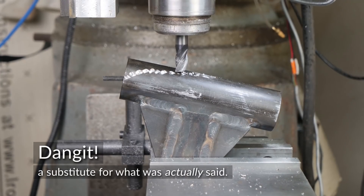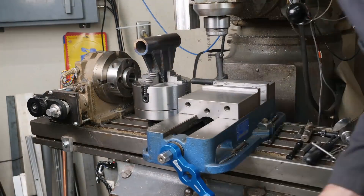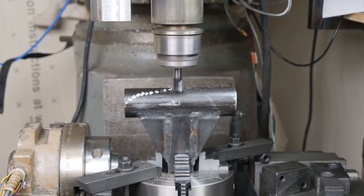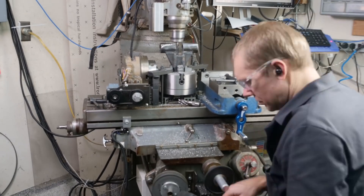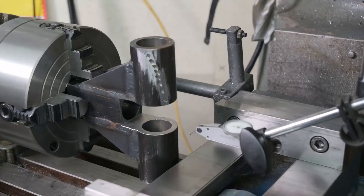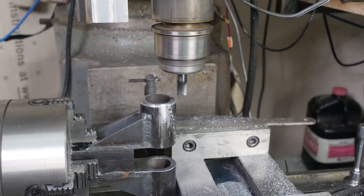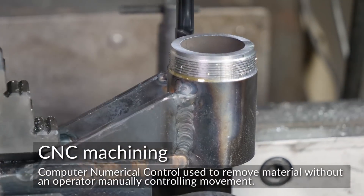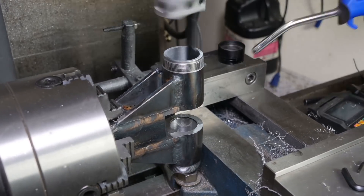Let's just learn from it and start over, taking smaller bites. Another expensive tool! How about we borrow the chuck from the lathe and pin it down that way? Hey, that's better! How about we hold it horizontally like it's going to be used? That'll make sure it's as accurate as possible so it doesn't wobble when it's spinning super fast. But this video is about wind power, not CNC machining — check out my other channel Build 2 using the link in the description.